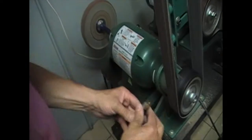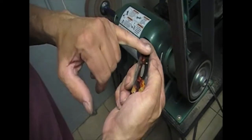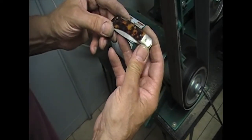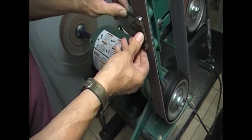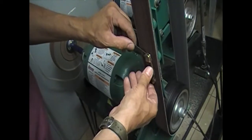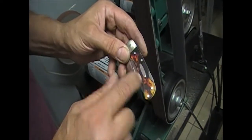We've got a little bit more right there. Pretty much got everything cleaned up all the way around — there will be one more operation with a Scotch-Brite belt after we get some other work done. The only other thing we're going to do right now — this knife has already been flat sanded so all these pins are knocked down pretty good. Celluloid will burn and melt, so you want to make sure you keep the belt grease on there and don't try to take too much material off at once — give the belt a chance to cut.